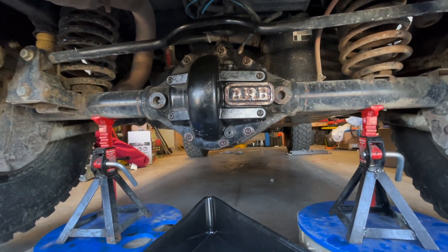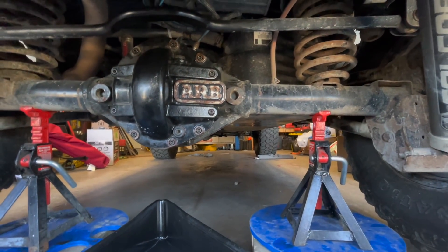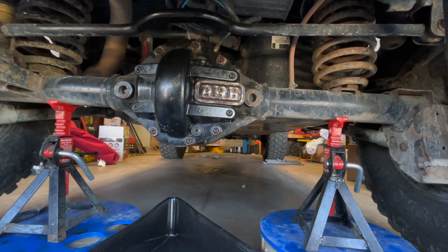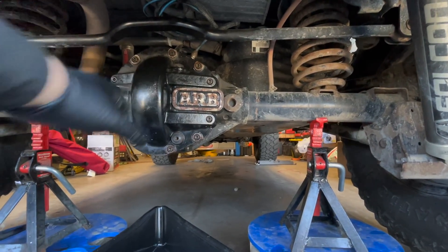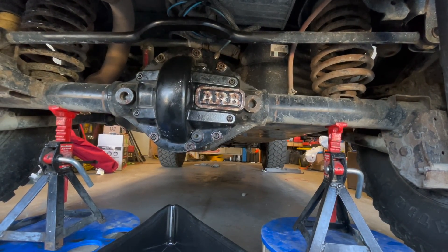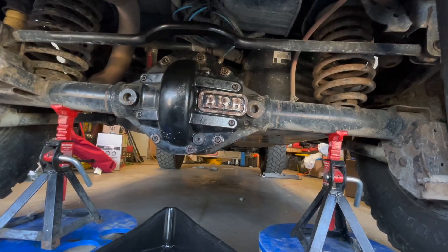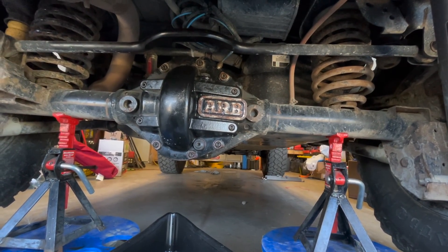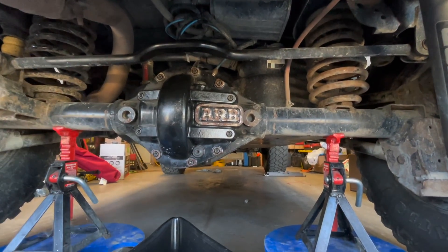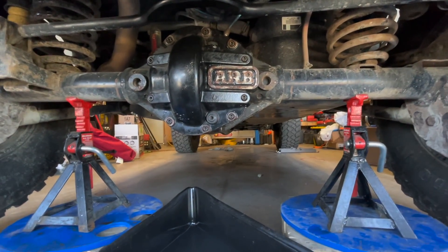This is debatable - there are no lock washers on these socket head bolts. I'm not a fan of them. I probably could have used Loctite but the threads inside are so small they could strip really easy, especially with this style of fastener - it's easy to round them out. I could have also used some RTV gasket maker on the threads to help seal it in place. I just tightened them down in a crisscross pattern - going to have to check them again because with our climate the moisture and corrosion will lock them tight in themselves.